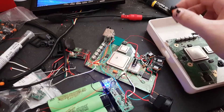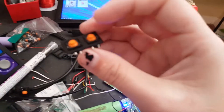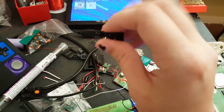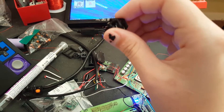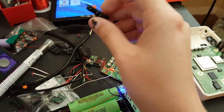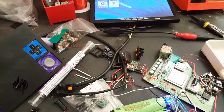I do have the tack switches figured out. I found that you have to glue the tack switches together even though they're in the bracket and can't move a whole lot. If you glue them together it helps tremendously with your button not wiggling — it feels nice and tight. Before that it was kind of wiggling around, and it took me a while to figure it out.